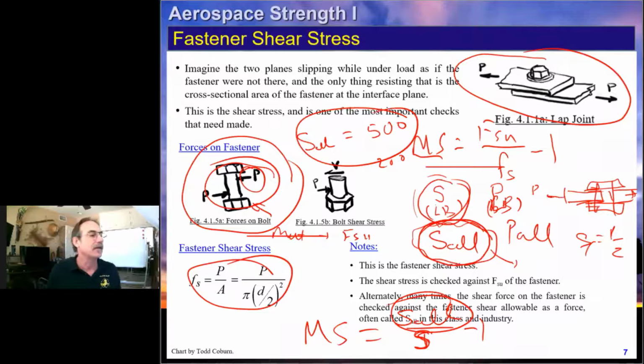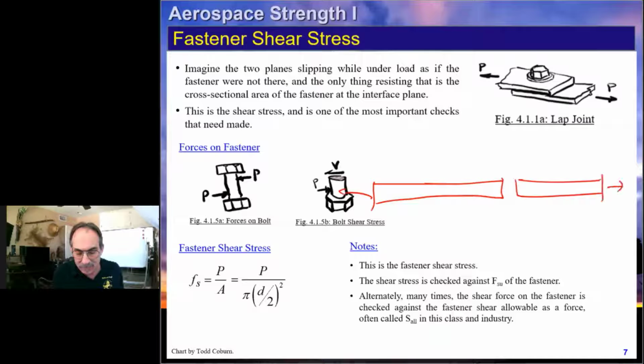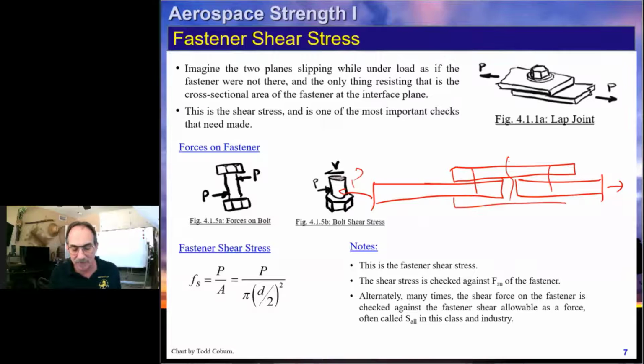So, Professor, if you remove either the top or bottom plate, just leave one, the full force will be transferred to that single plate, correct? Yeah, let's say we have a butt splice that's poorly designed, and we only have one splice plate. In this case, now this is just like a lap splice. It's like two lap splices in a row. And you're going to end up getting bending in this plate that you're going to need to check, plus some other effects. This is rarely done. Usually if they use a butt splice, they would have back-to-back splice plates. They use a lot of these.